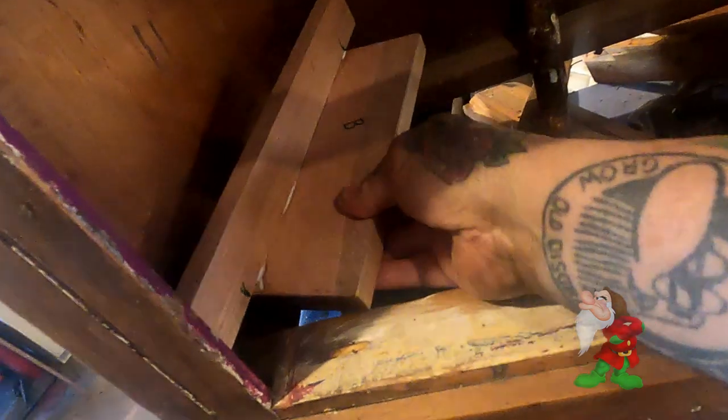Right, I've got all these made, they're all just sitting there. I'm just gonna leave them till tomorrow, let the glue set properly. I'm gonna put them in, measure up, nail from the other side, and I'll probably just skew nail from here. But they'll be glued front and back, so that glue will hold it. I'll do the same all around this one. This one it's a little bit tight, I might just sand a little bit off it, make it so it's just neat. So I can glue it, and then I'll do the same. I'll skew nail it from the front, and then measure up from the bottom and nail it at the back.